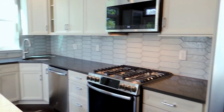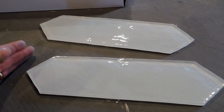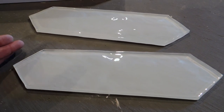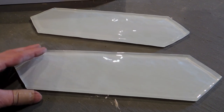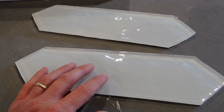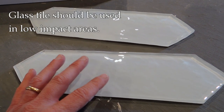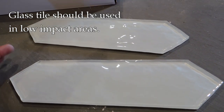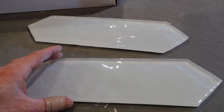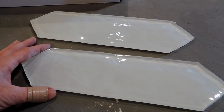You can see how it all came together. The takeaway is this: I'm not against glass tile or large format glass tile. If you like the look, go ahead and use it. But there are differences in installation that you need to be aware of. If you're having someone install glass tile, it's probably going to be more expensive than installing porcelain tile. As far as durability — it's glass. A kitchen backsplash usually doesn't take too much use, although if you tend to slam appliances like toasters or blenders up against the back wall, it may be a concern. In a shower, I'm not super sold on the idea. If you're paying someone else to do it, be expected to pay more for it.